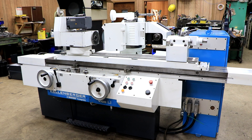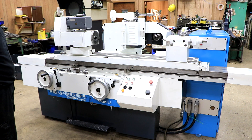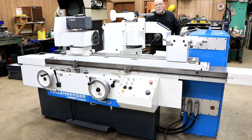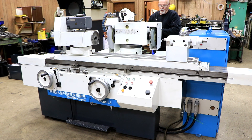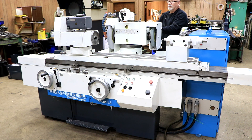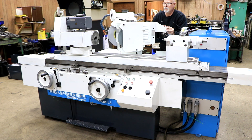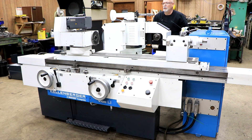Here we have the machine now safely turned around to use this grinding wheel if you were going to do some kind of face grinding. I just made sure that my wheels weren't going to hit anything. This machine is pretty long — you don't really have to take the tailstock off. This is where we were, and there are two levers on top here. This one is just a clamp. This one is a clamp and it disengages — it has a spring pin that drops in, and then you tighten it. When you pull it all the way back, you're lifting that pin out so that you can rotate this. When we go to this angle, I'll just let this off, and when it gets where it needs to be, you give it a little jiggle and it's locked in.